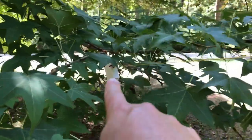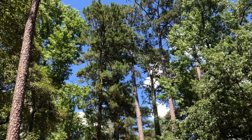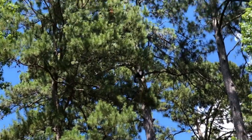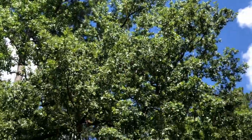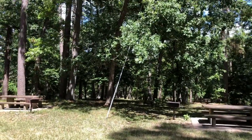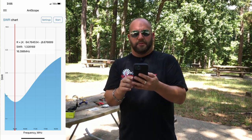Here's the antenna shot — feed point in the tree, wires going out with visible links. There's the link for 17 meters, a few more feet to the 20-meter link, and then going off to 40 meters leaning in the tree with a pole. Checking 17 meters on the AntScope app with the RigExpert Stick Pro analyzer, we're at 1.32 to 1 at 16.396 MHz, so we need to trim a bit. Going to go ahead and trim that.